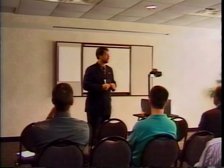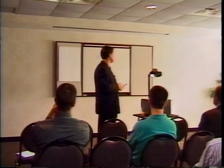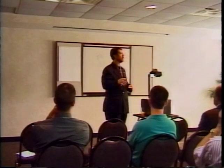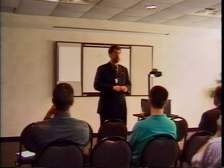And when we talk about dynamic and static, we also have that in poise too. We talked about the 180 degrees amplitude for taking your readings for dynamic poise, static poise on the old-fashioned poising tools. Okay.